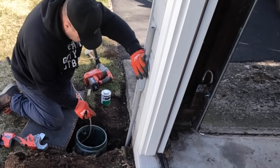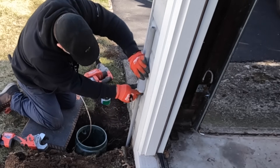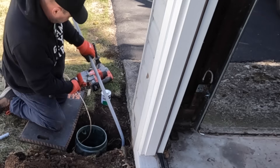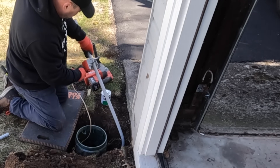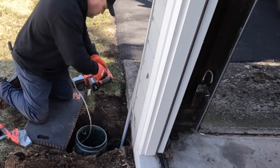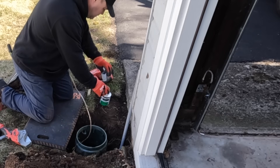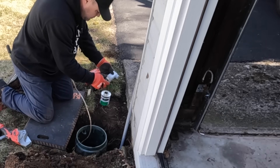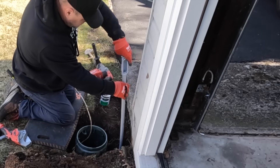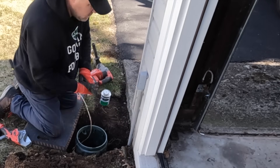I'm using three-quarter inch PVC — it's pretty standard. I don't like using half-inch PVC because the spacing inside the conduit only leaves room for a few conductors should we need to add some. I don't stock any half-inch PVC; everything I do for something like this is in three-quarter inch. When you make the hole for the conduit fitting through the framing or through the outer sheathing, you just want to make that hole a little bit larger than it needs to be so you have a little wiggle room with the fittings. I've learned that makes the job a lot easier.